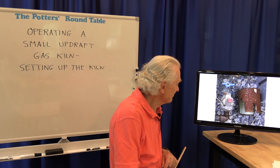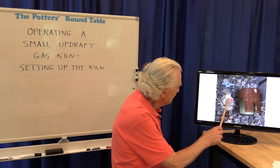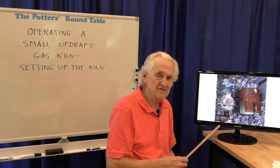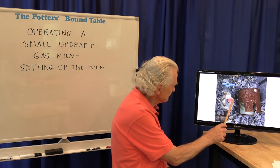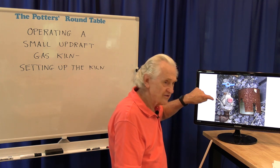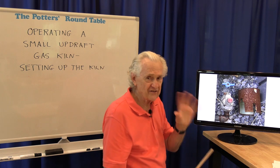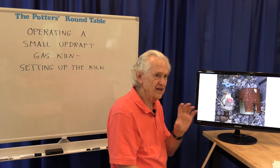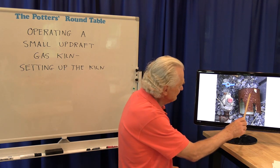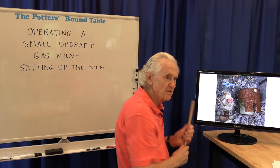Or is that it? Okay, this was one more little extra detail I wanted to show you: Basso valves, I don't believe, are particularly waterproof, because this is the button that you push down on the top of the Basso valve when you're starting the gas. And so I cut a tin can. By the way, it has to be an imported tomato sauce can to really work well. I cut out openings in it so that it'll slide down over the top of the Basso valve.